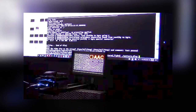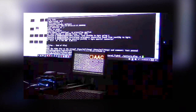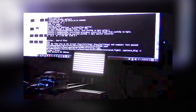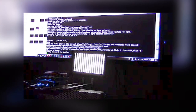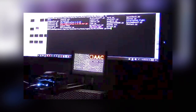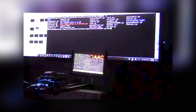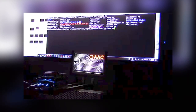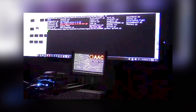The BeagleBone is a Linux-based system, so if you're comfortable with those, you can get around and start using this almost immediately. I did write a couple of very simple scripts that you'll find at the end of the file that might make it a little bit easier for you to use. And if you're familiar with cron, you can edit your cron tab to include it at reboot to use these scripts to turn the display on and off just as soon as the BeagleBone turns on.